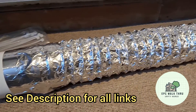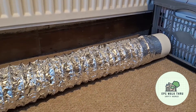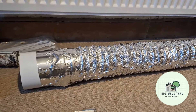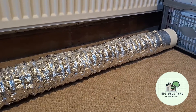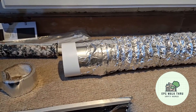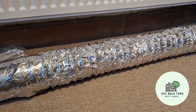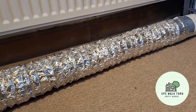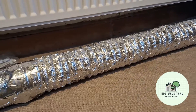For the ducting, I've got two end fittings — sleeves designed for going through the wall — and I've stuck them on either end of a tumble dryer one-metre flexi pipe. I then cable-tied the front pipe onto each end of the through-wall sleeve pipe, duct-taped them, and wrapped the assembly with PIR joining tape to strengthen it and provide some insulation so the humid air won't condense within the pipe as it goes into the loft.